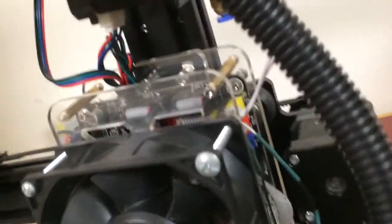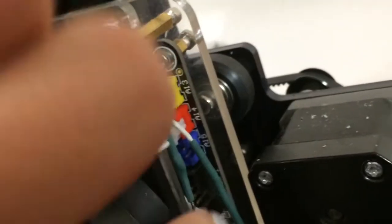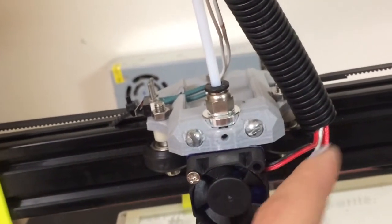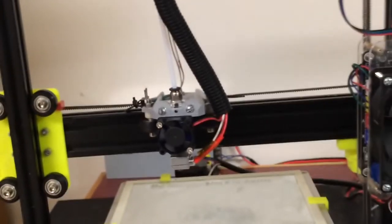The new wires were really easy. I had to rewire over here so that it could click into here — this is part of the heat section for the hotend, so I just rewired them right here. I did some rewiring from the fan from the old one because it was a plug-in fan. I cut off somewhere in here and used the old wiring, and that should work well. Let's power on the printer and check out how it works.